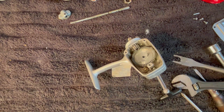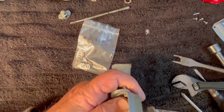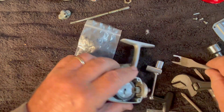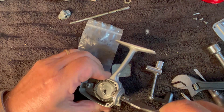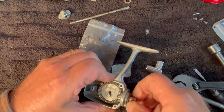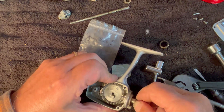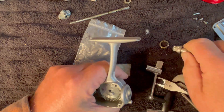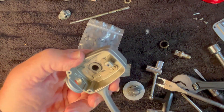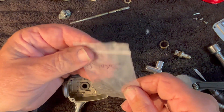We've got play there. So I'm going to try to shim this and see if by shimming it, it will take that grind out. I have two different sizes of shim as far as thickness. Now I'll unscrew this to pull it back out and I'll see if I have any shims that are capable of taking up this play without making it so tight that it can't move. There are no shim washers in it. I have a feeling this once had a shim washer in it and somebody has lost it.